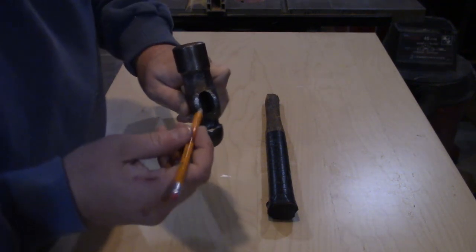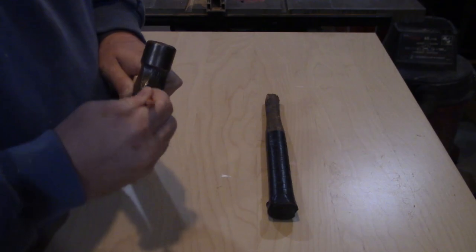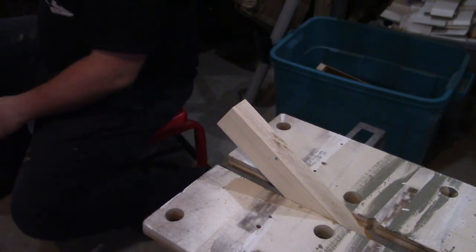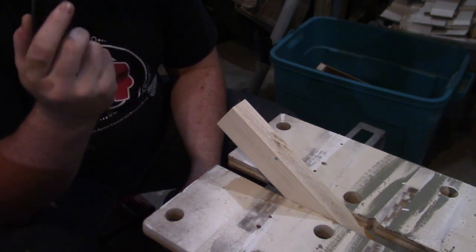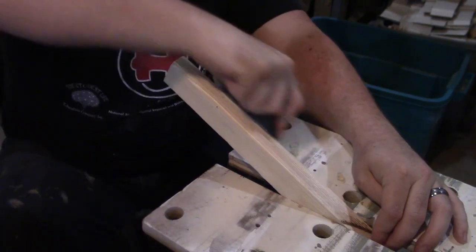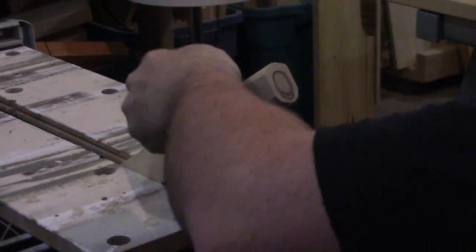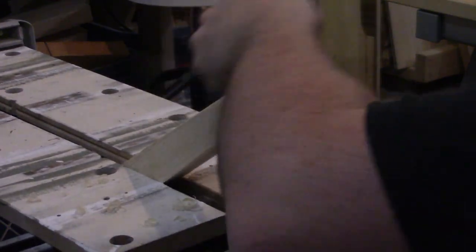Since the hammerhead isn't going to fit on the new handle as-is, I hold the hammerhead up to the end of the handle and mark out the size of the eye. Then I clamp it down into my portable workbench — this isn't the right tool for the job, I know that. I don't have a spokeshave or a sharp knife, so I'm going to use my small three-inch trim plane to start planing the handle down to size. It took a while to adjust the cut depth to the sweet spot where it would make a decent cut but not jam up.